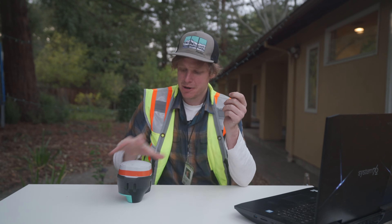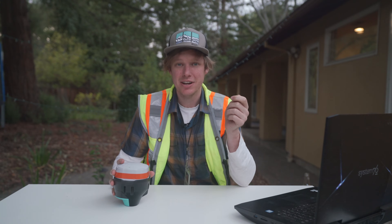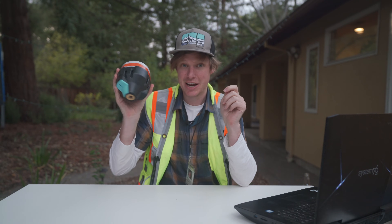To recap exactly what I did: all I did was plug in that USB drive, put the file from the base station on there, and double-clicked on the PC Master project file. It asked me the precise location — I put in the latitude, longitude, and ellipsoidal height — then I just let it go. It produced the trajectory, did all of the calibration. Then all I had to do is select where I want to start and end on that trajectory to generate the point cloud. After this, I simply double-clicked the PC Painter file, brought that point cloud in along with all the photos, and it generated the colorized point cloud. At the end of the day, we have a colorized geo-referenced point cloud in just a couple of clicks.